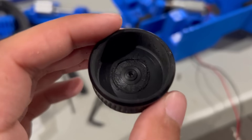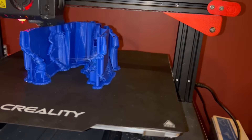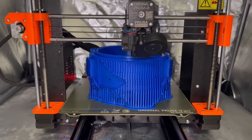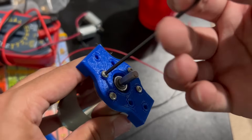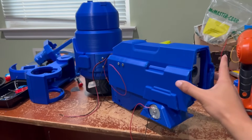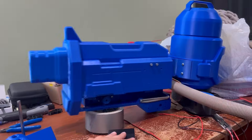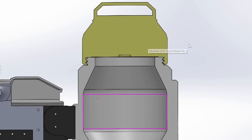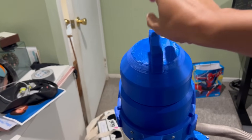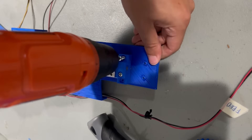After taking Timmy apart, I found one screw had loosened and started searing into the plastic flywheel, causing the smoke. The recoil motor also broke, so I redesigned the turret head to house a larger one. The three-symmetrical-tooth design was getting jammed, which I fixed by moving to only two teeth. I also replaced the rubber bands with springs, since they might rot over time. For the ammo canister lid, I flipped the threads and added a plastic cap that squeezes down and acts as a gasket, preventing air from the vacuum from escaping. The new flywheel motors are finally here.